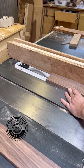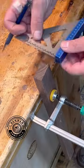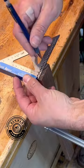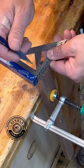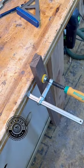I'm using a three-inch wide piece of walnut. I ripped it down the middle after cutting it into two lengths, and now I'm going to mark an angle. You can see me doing that because that's the piece I'm going to cut off to give me a little bit of an angle on the front to make it beveled.